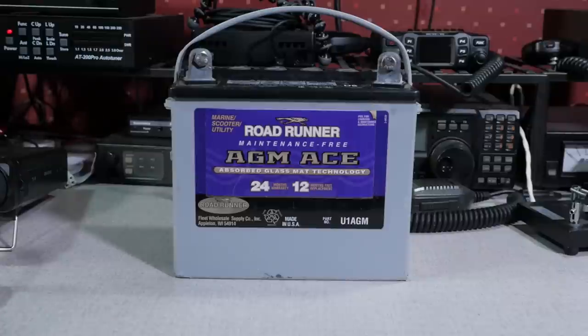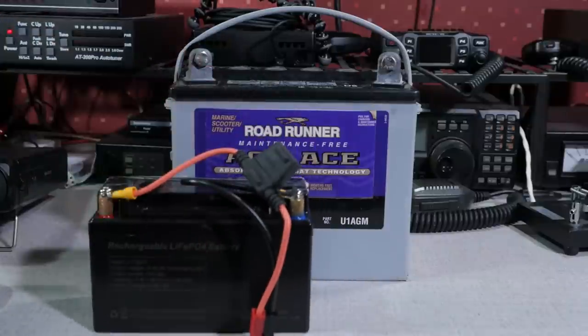What are the downsides? There isn't much of a downside other than you're going to need a lithium iron phosphate compatible charger. If you plan to use solar to charge the battery, you'll want to make sure your charge controller also has a lithium iron phosphate or LiFePO4 setting — most new chargers and controllers do have this feature. Another consideration is that while lithium iron phosphate batteries will operate in colder environments, they will not charge if the battery is colder than 32 degrees Fahrenheit. For the price, this is an excellent value — I spent just as much money a few years ago for a U1 size 33 amp hour AGM battery, and this little lithium iron phosphate battery delivers consistently just as much power.